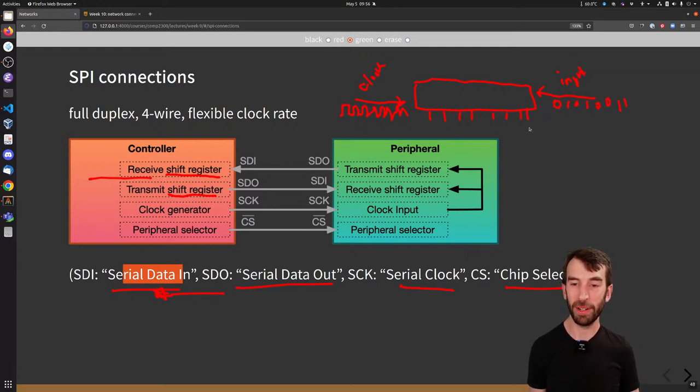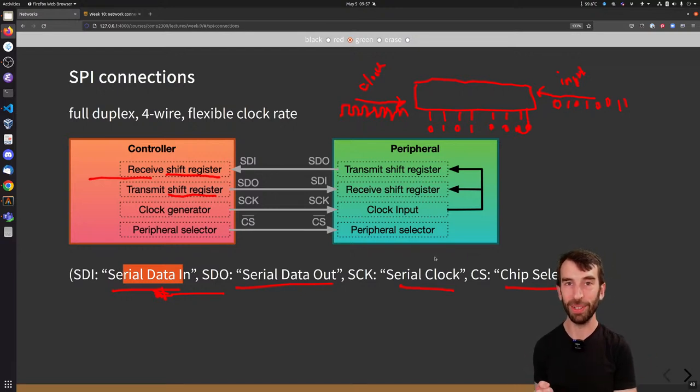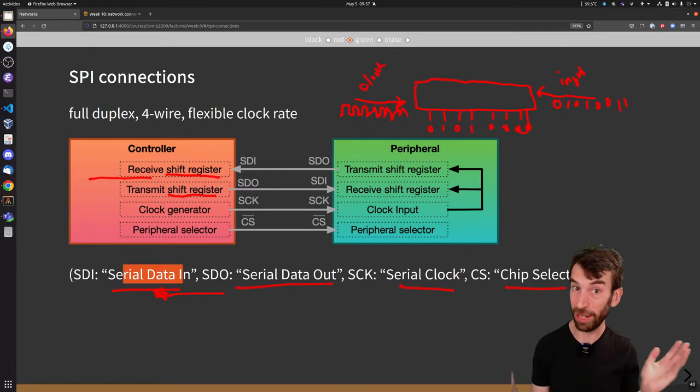After the first step, the 0 comes in, it ends up here. Then the 0 moves down the line, until it's all shifted along by one position, and after all of those bits are clocked in, we've got our message in parallel. So you might use a shift register inside a computer to translate something happening on a serial line into a parallel format, so it can be read directly from a memory-mapped register by you in your computer in some way.